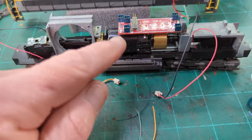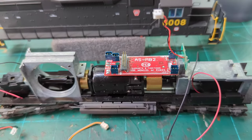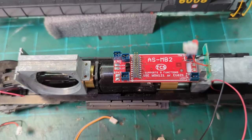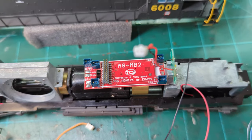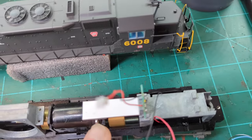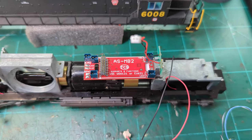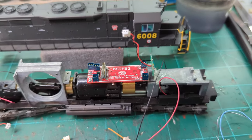So I took these off. I'm going to use this because it's orange and gray, for the motor. It's kind of hard to see here, but you can see where the one connector is. That's actually the negative. I'm going to run that through that opening right there because the motor connector is that socket right there. The other one was a lot longer, so I'm going to take this, see how it fits, and run it down through. I can tape it along the side to there and to the other side, which is the positive and the negative. That should keep everything inside. Again, you've got to watch clearance on these puppies. It'll keep everything inside the width of the board if I run it up through that connector in the center, just by rewiring it. Not a big deal. I was probably going to rewire it anyway because it was way too long for the way it was looking.